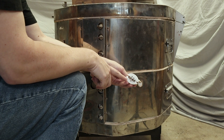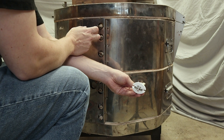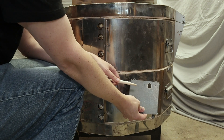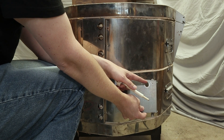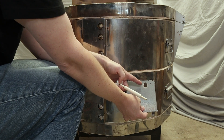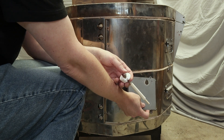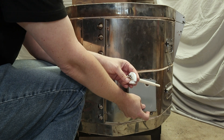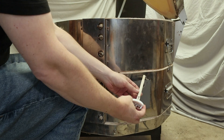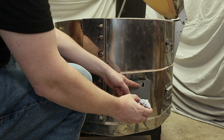The next thing to do is to mount the block onto the kiln. I don't want to screw it directly to the outside of the kiln though — it would stick too far in. So I'm going to reuse one of the pieces that was part of the kiln sitter. Here is the mounting plate for the kiln sitter. I've enlarged the hole slightly so I can pass the thermocouple through in the right spot, and I've added two small holes so I can screw down the block. I'm going to attach this plate and then insert the thermocouple, passing it through the hole and mounting the block onto this piece of sheet metal.